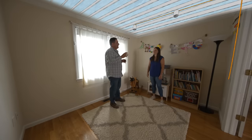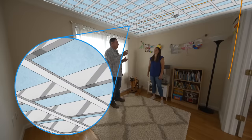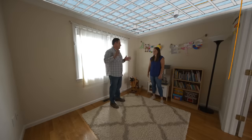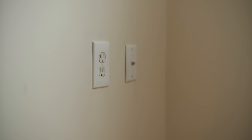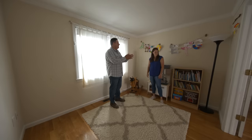They also found strapping in the ceiling, which lets them snake wire underneath the floor joists between the strapping to go from light to light without extra damage. They identified what the switch controlled: a receptacle in the room where the bottom half has constant power and the top half was switch-controlled via a 14/2 wire. The plan is to rewire it so the whole receptacle has constant power, and send that power over to the switch to control the new recessed lights.